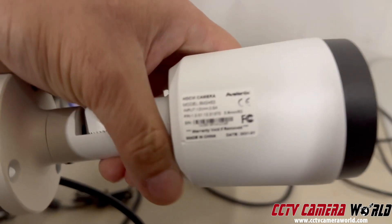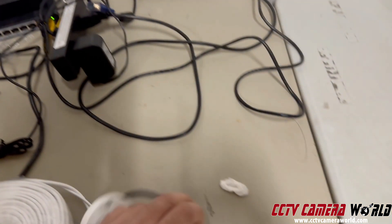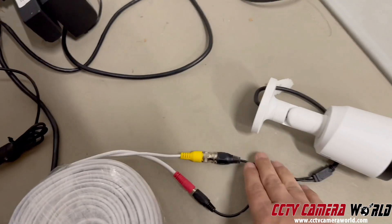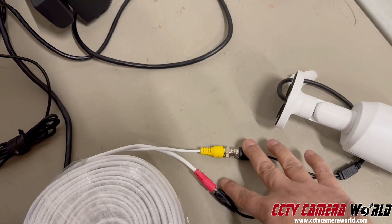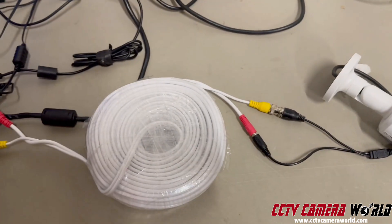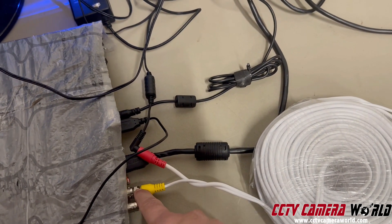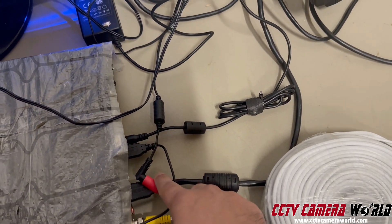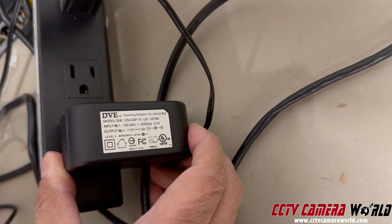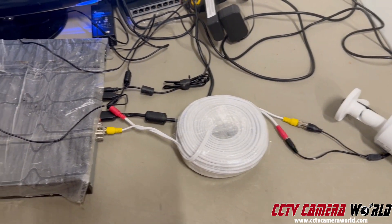Here I have a 5 megapixel 5M2452 — it's an HDCVI camera, so it outputs 5 megapixel resolution out of its pigtail. This is a coax camera so it's got a BNC and a 12V DC power connection, and I've got a Siamese pre-made HD wire that's well suited for 5 megapixel resolution — this is a 100 foot roll. On the other side I've got the BNC connected to the DVR and a power supply that's a 12V 1.5A. Depending on the needs of your camera you can use a 12V 1A; this one would work on 12V 1A as well, I just happen to have a 1.5A lying around.